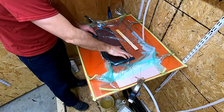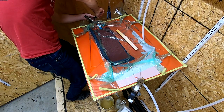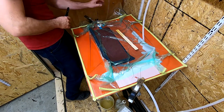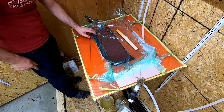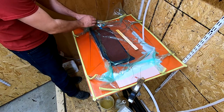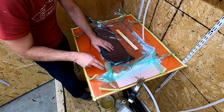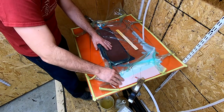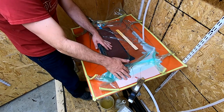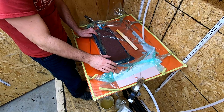As you can see, the part is nice and wet out. In time lapse, once I pinched this off, there was still enough volume in it to make it the rest of the way. Our resin break is doing its job — air can travel through the peel ply, but it's really hard for epoxy to make it through. At this point we're pinched off and we're just going to let it cure and demold it when it's finished curing.